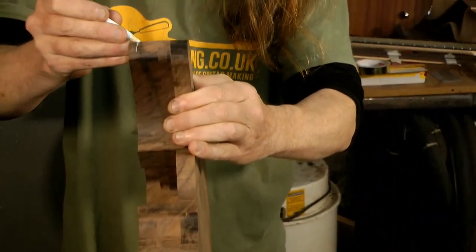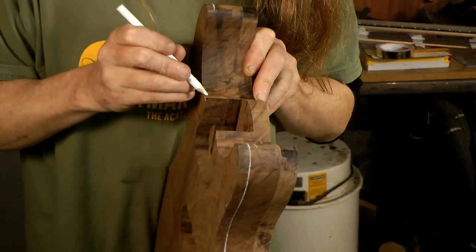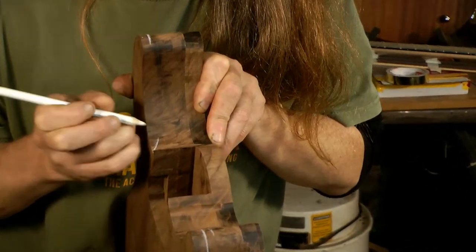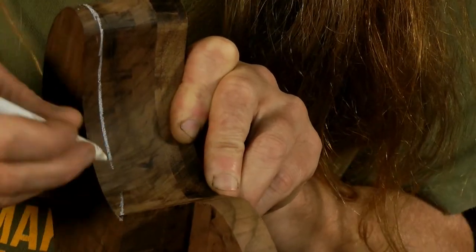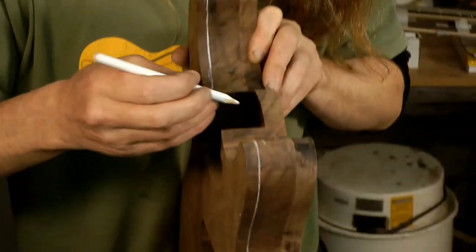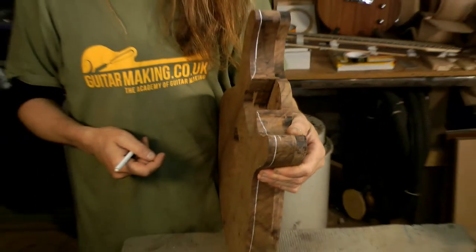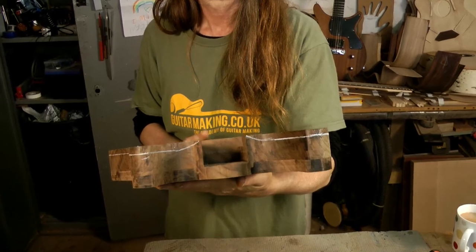But as we all know, whenever you're carving round shapes, you always start with facets. So what I'm doing is I'm marking on the first facet. So here at this tip, it goes from the tip down, and in the center of this horn here is full depth. So it goes on to full depth and then curves up just like that. Same on the other side. And we can decide to go as deep or as shallow as we want on this. But that'll do me. Can you see that? Yeah, great. Sort of shape there. I'm going to come in a bit. I can just do that.